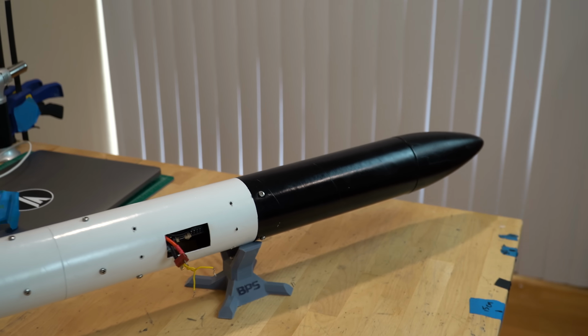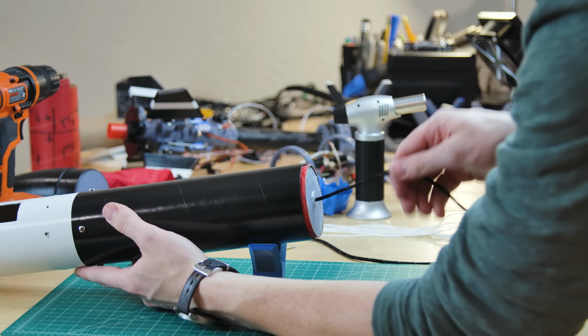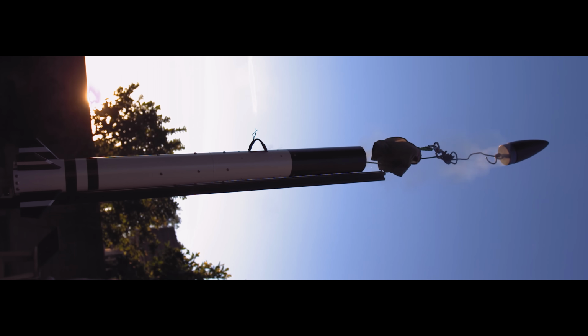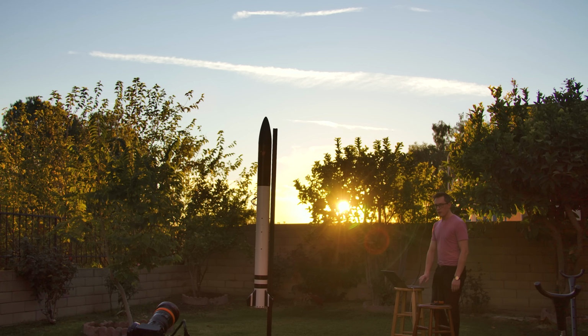The chute is deployed with a small piston up here, and it uses redundant charges, which means that we fire one at apogee, and then if we notice our speed is going too fast on the way down, we deploy that second charge. I ran a pop test with about 0.7 grams of black powder, and the chute barely came out during that. So I upped it to 1.5 grams of black powder, and that should get us all set.